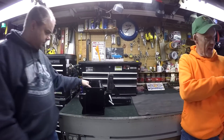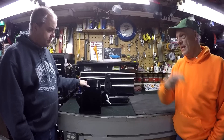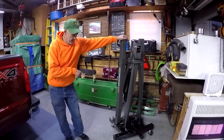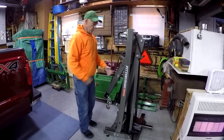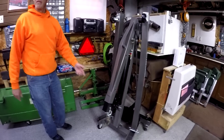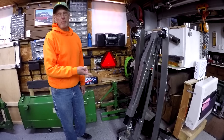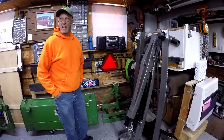If I wanted to take and move that quick attachment blade, or move my snowblower out of the shed into here, I could just use the three-point hitch off the back, pick it up, or I could hook this in my heavy hitch and grab it. So this is some sort of a hoist — it's a folding engine hoist. These legs fold down and I tried it yesterday. I welded that plate to it, and I can put that right on my hitch receiver, and then I can pick that up if I need to move a generator or something small, load it up and put it in the back of the truck, or I can put it on the front of the tractor on the loader. So you use it sort of like a boom pole? Yeah, a fancy boom pole — that's the idea.